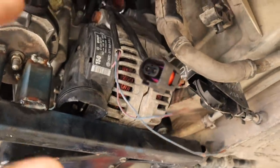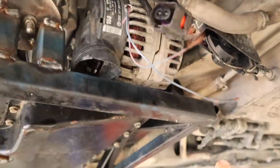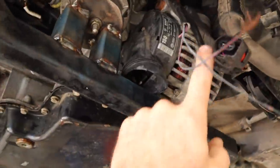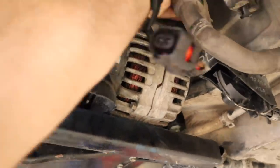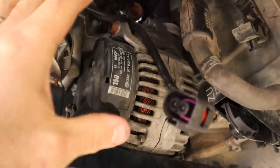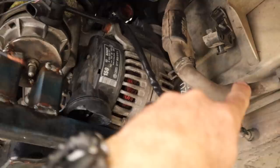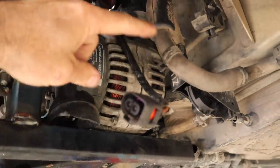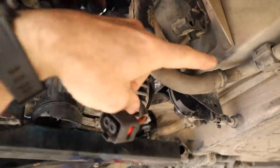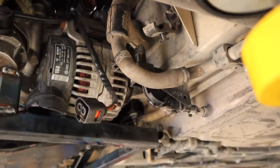I've been working for hours here working out the ducting of all the radiator plumbing. This is the inlet to the water pump — the pipe's got to come from the radiator outlet, around this corner, up and over here, and into the water pump fitting at the back. Along this section I have to make the pipe come out and around, but in this area I have to make it join up to this pipe here. So I've got to put a T-piece — I'm going to make up my own little aluminium Y-piece to connect up to the expansion tank. I'm going to custom make that now out of aluminium.